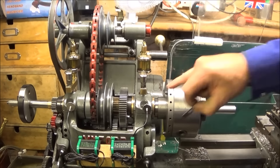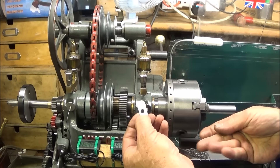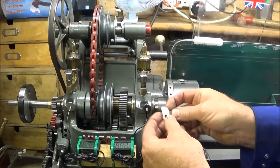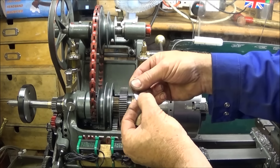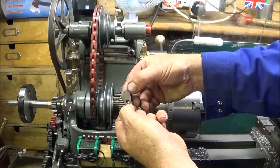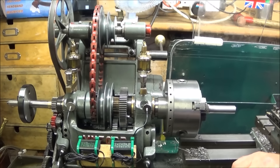With the new spindle, the only other thing I got was the actual proper Myford laminated shims to go under the bearing housing caps. These shims are pressed fit together and you can actually peel two thou off at a time to get the adjustment correct on the bearing.